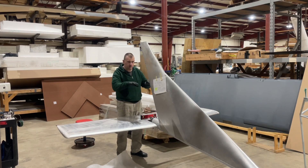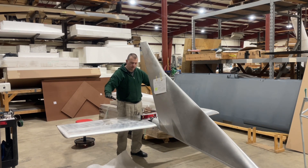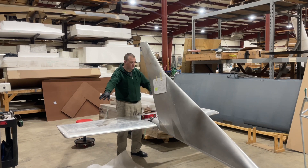There are a couple things I need to do: balance, level the frame, and level the stabilator so it's all level and equal. Then do some measurements from the fuselage down frame back to the wingtips to make sure the distance is correct. I've already done those steps and it's about 92 and 7 eighths on each side from that center down tube.